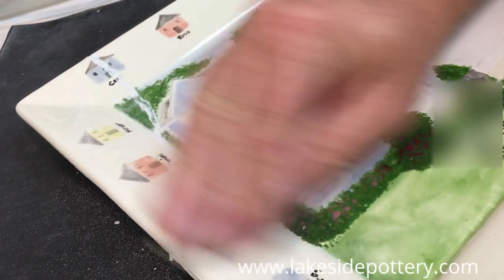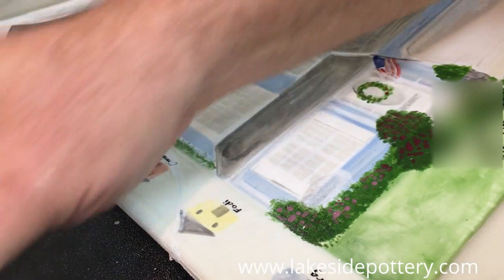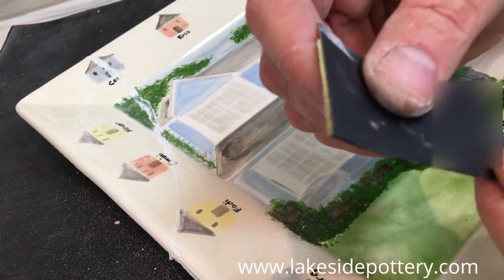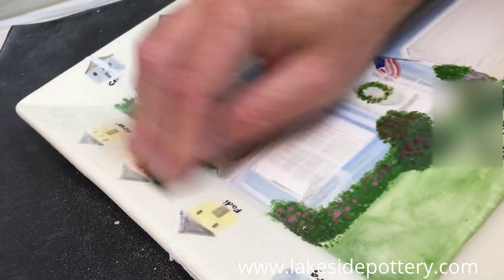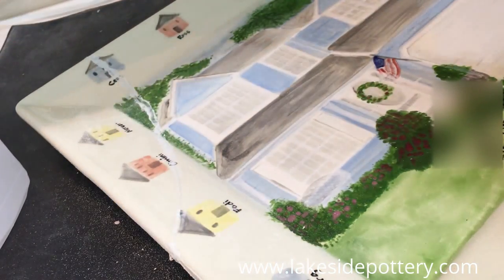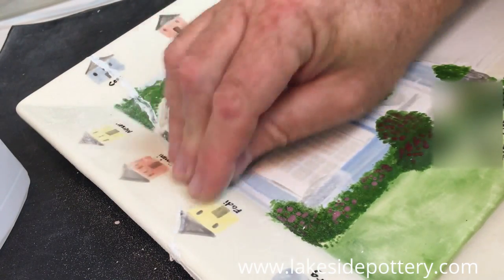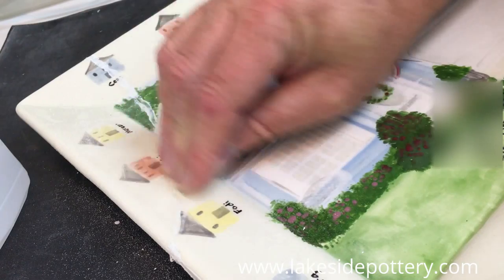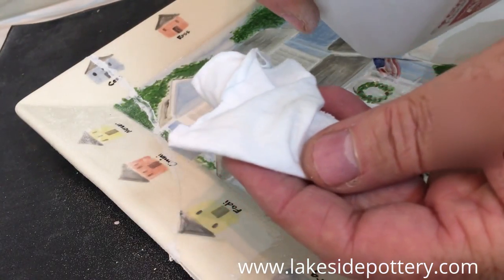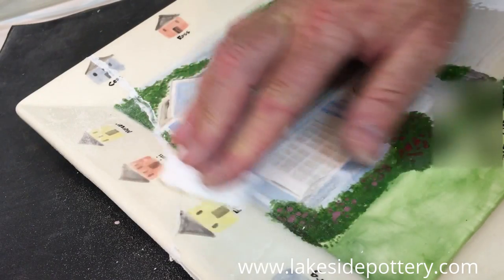When done with 120, check it — I rely mostly on touch, not visual at this point. Then go with 400 grit — fold it and again go fast. It is much smoother now. The last step is micro mesh 3200, extremely fine 3200 grit. Stay with it a little bit, and when done with the whole plate — whatever item you're repairing — clean the surface with 91% alcohol. It's now ready for painting.